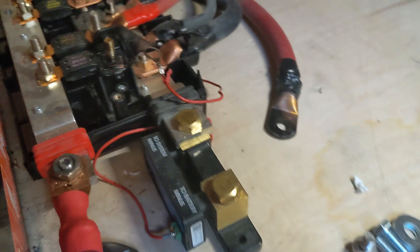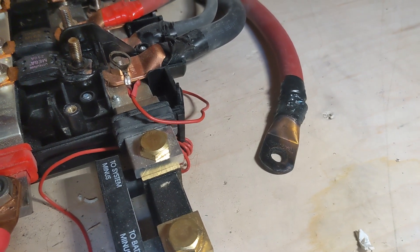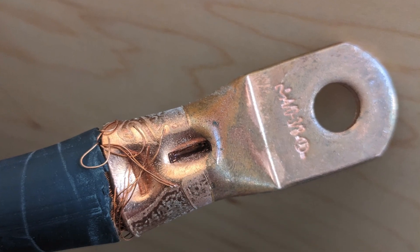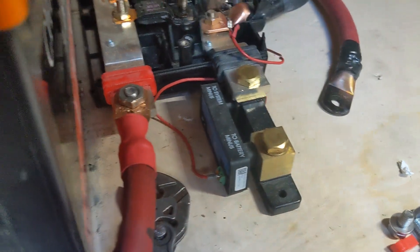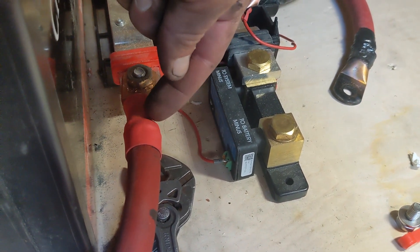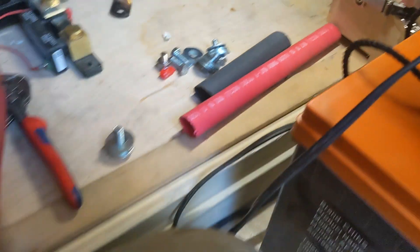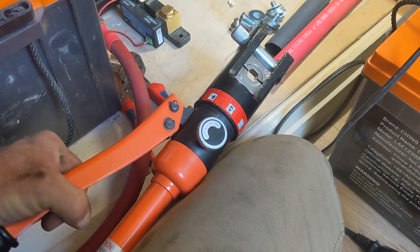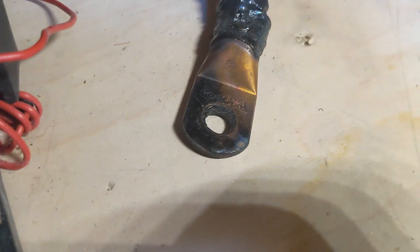None of these crimps were proper — it looks like they crimped with a flat blade screwdriver and a hammer. Here's a picture of what those crimps looked like. Because they were loose, they were creating a lot of heat through high-resistance connections. This is a properly crimped connection covered with heat shrink tubing that has an adhesive layer inside — a proper mechanical weld done with a hydraulic crimp tool. The people that put this system together really ought to invest in a hydraulic crimper; it's under a hundred dollars and makes a proper crimp, keeping things like this from happening.